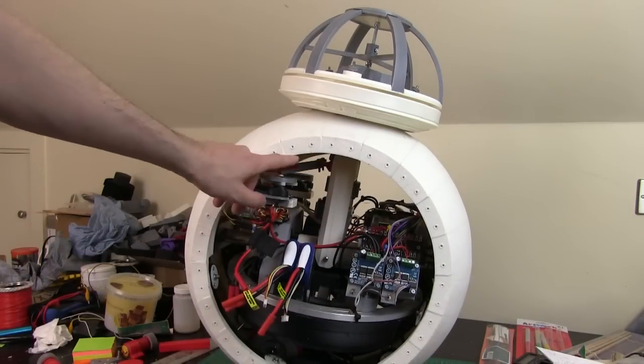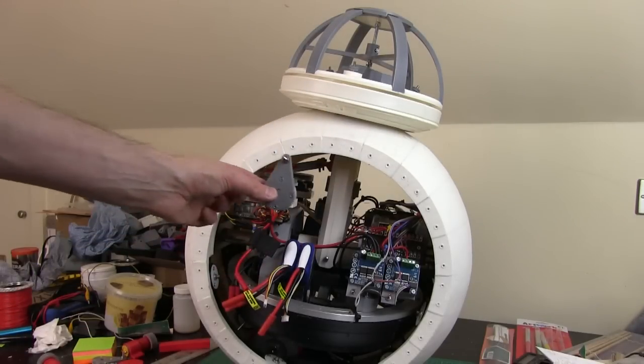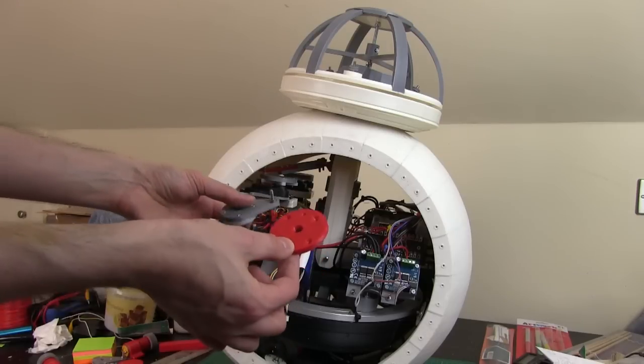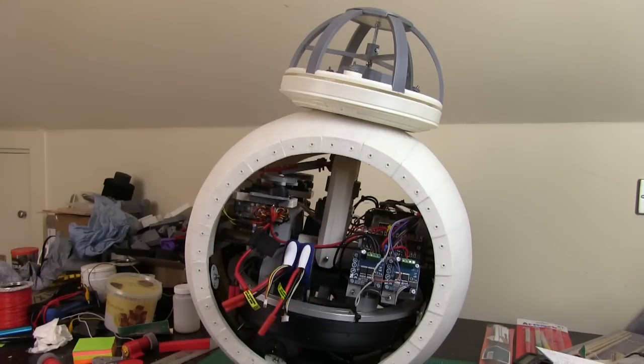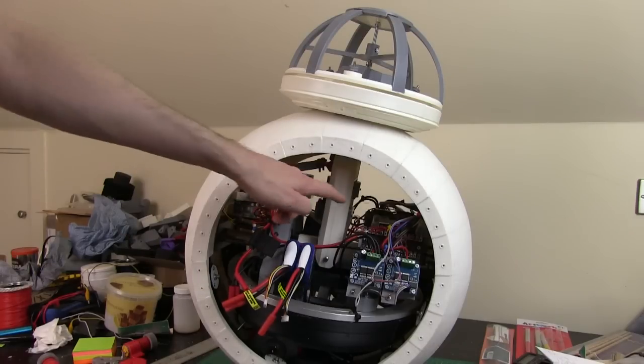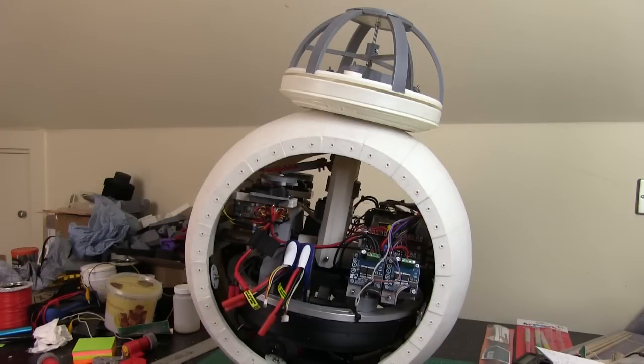I've also made new servo horns with a 30mm radius — I did have 40mm and 20mm, and I've made one in between. Now I can move my head all around backwards and forwards, left and right. I've also made thicker shims and moved this thing back up again, so I'm back up to the 15mm mark. I now have 15mm shims in there and that's made the mass a lot higher, and now it is quite a lot more stable. Let's give that a drive.